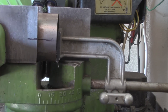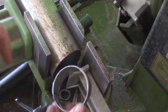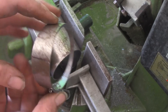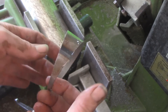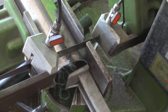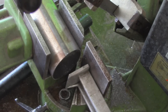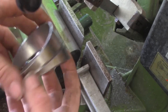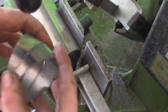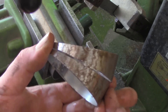I'll show you that later on in the video. Simply get in there, set the tube up to where it's straight and in line, and start cutting. There is a pie cut. Pretty simple. Now all I've got to do to make sure that they all get lined up exactly the same spot every single time is flip it over and cut again. Now you stick the two of them together and you notice that our seam reference that we left on top is perfect — it lines up and both pie cuts are the exact same spot.